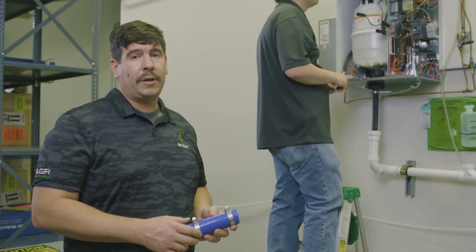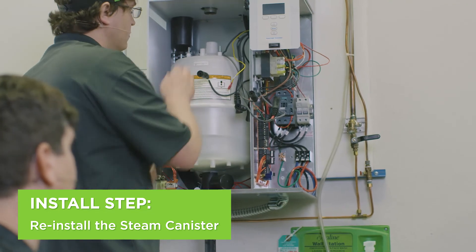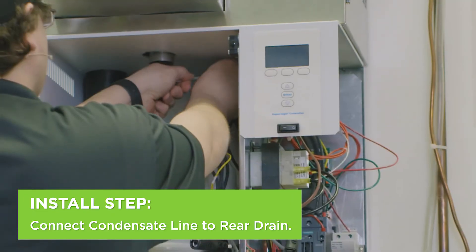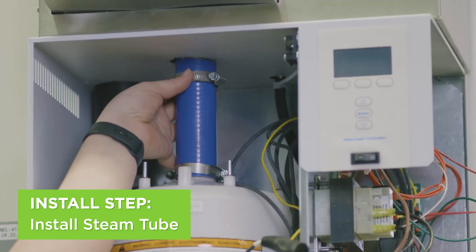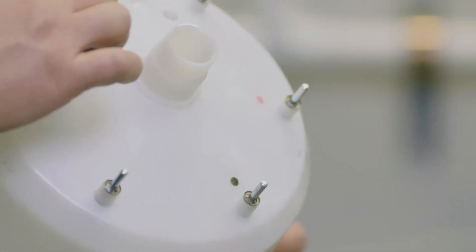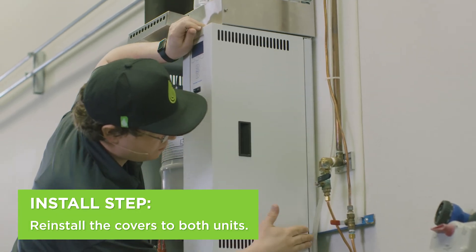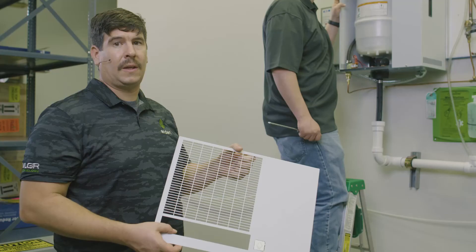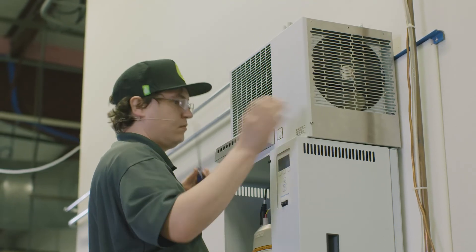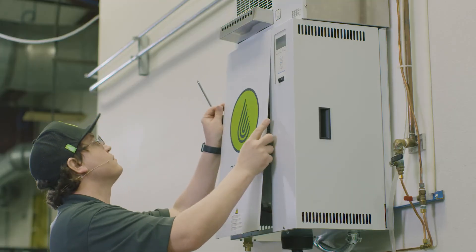Now that we've got the humidifier wired, we're ready to reinstall the canister. First, seat the canister fully in the drain valve, make sure your condensate line is on the back drain, and secure it with the provided zip tie. Install the steam tube. The cylinder's posts and electrode wires are color-coded — yellow is the high water pin. We're now ready to install all the covers: the electrical cover first, then the steam dispersion unit cover — tighten all screws, the two on the side and the one on top. The last cover to install is the cylinder access cover.